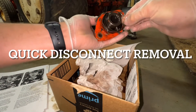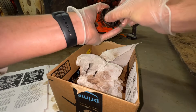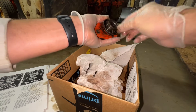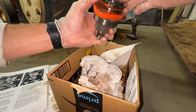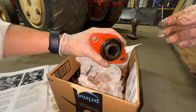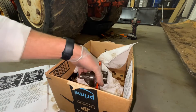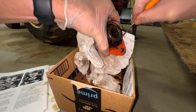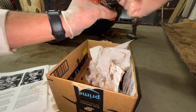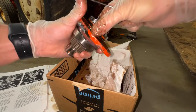You've got to take these three pins out, and they go out through the outside, which means you've got to push them forward to get the spring out of the way. There's one pin — get more clearance — there's two, there's three. Now let's try to get the spring, which is locked in here, using a pick one more time.